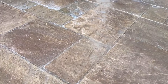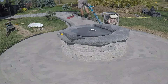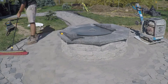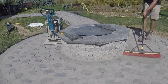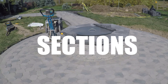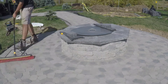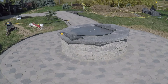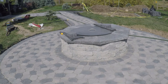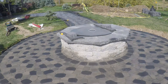You want that level to be accurate before activating your polymeric sand, or else you'll get that surface crust. To summarize: number one, caving in — likely a consolidation issue. Number two, sections that are loose while others are good — likely low spots accumulating too much moisture. Number three, most of the project is completely loose — either an installation factor or an environmental factor, essentially too much moisture in the system. And the bonus number four, a surface crust with loose sand below — likely the polymeric sand was installed too high.